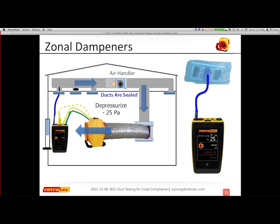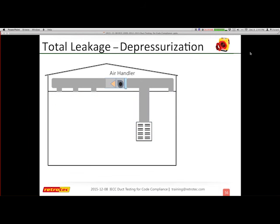An economizer is more for a commercial application. That's actually next Tuesday, so I won't talk much about economizers in general, but I will talk about what those are. An economizer is where it actually uses the temperature of the air outside to help temper the air for the interior part of the area. So when you go to any kind of commercial place, especially like a theater, and you wonder why it's really hot or cold, it's because they're using outside air to try to condition that to save money. Thus the word economizer.